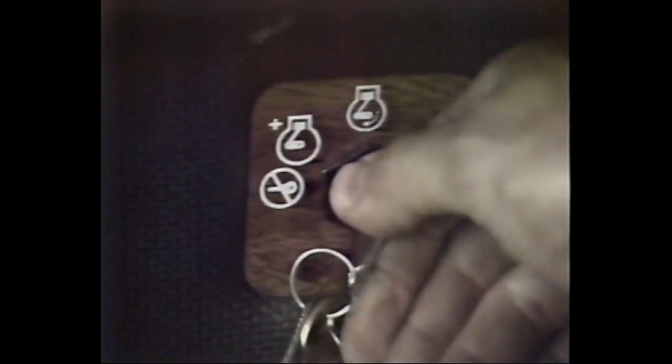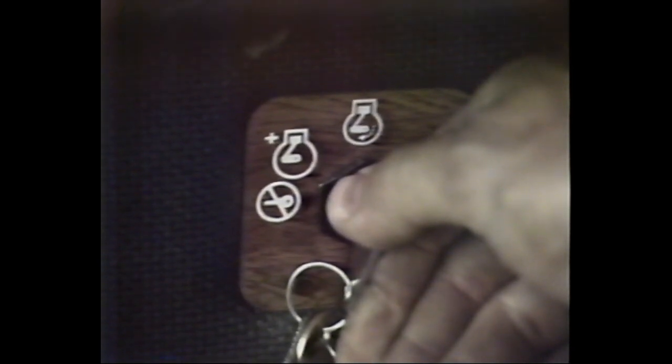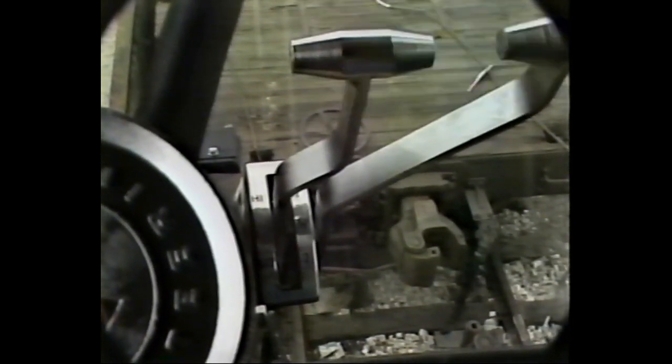If the engine is turbocharged, pull the stop control into the up position and crank the engine for approximately 10 seconds. This will lubricate the turbocharger. Once this has been done, or if the engine isn't turbocharged, proceed by putting the transmission in neutral and placing the engine fuel stop control in the down position. Now, push the left foot pedal down to engage the ignition switch and crank the engine. When the engine starts, observe the oil pressure gauge, temperature gauge, amp meter, and fuel gauge to make sure they activate properly.